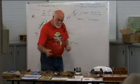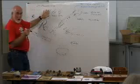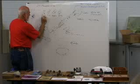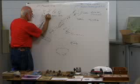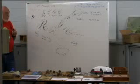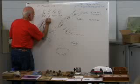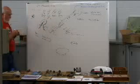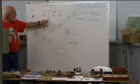So, House of Jewellery, they have a huge range of all these tools in all different sizes. If you are buying these yourselves, I'd recommend when you ask for an onglet, you ask for a number 3. Number 3 is just a nice size. The flat, they're sold according to the width of that cutting edge there. Now the ones that I usually start my students with are number 10, which is 1 millimetre across there. But they can come down to 0.5 of a millimetre, or 0.7 or 0.8. You can get them in all these different millimetre sizes.